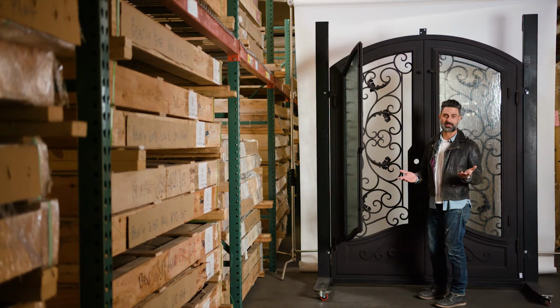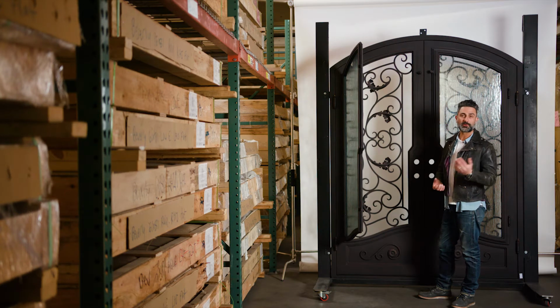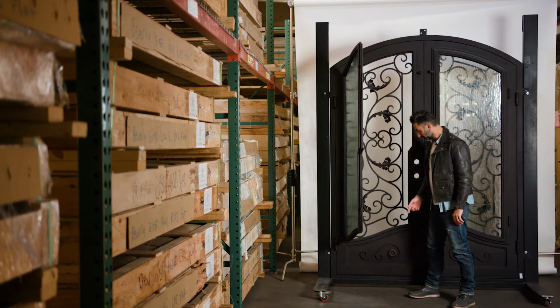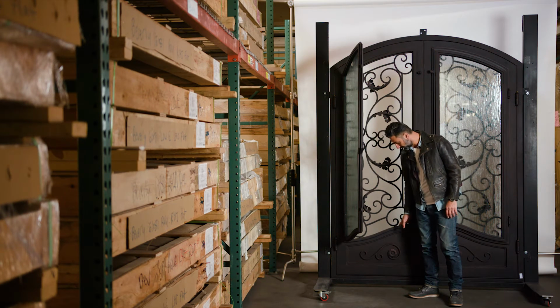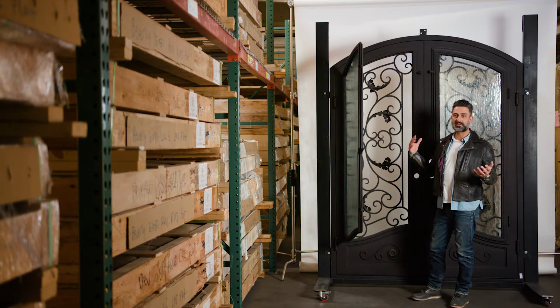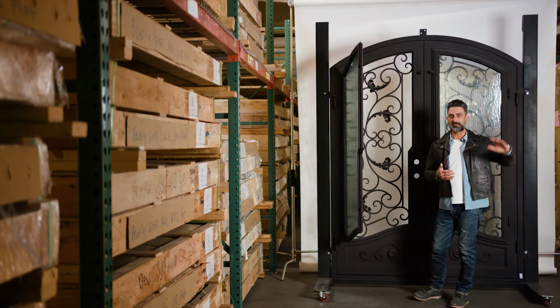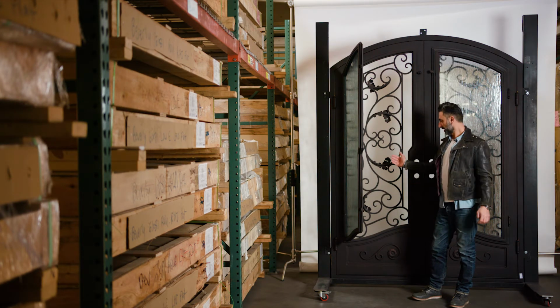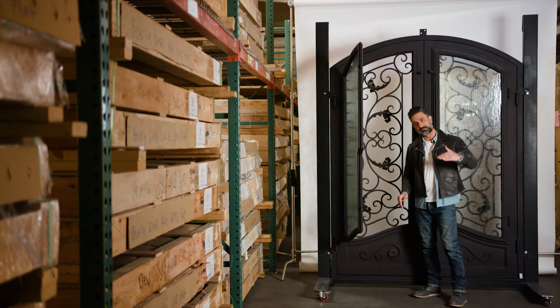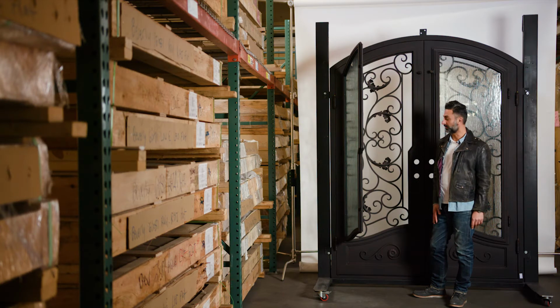That's to keep a double seal on the glass, obviously on areas that are super duper windy, so you don't have any whistling inside. Another thing we do is this bottom tube is always sloped a little bit down. So if you have any kind of storm coming in, you have sideways rain, and your overhang doesn't cover enough, and you get any kind of water here, it kind of diverts itself, throws the water out, so it doesn't sit there because it is a metal door.